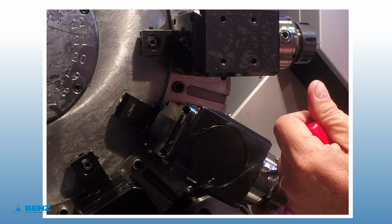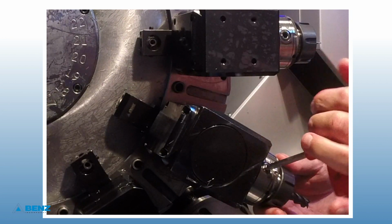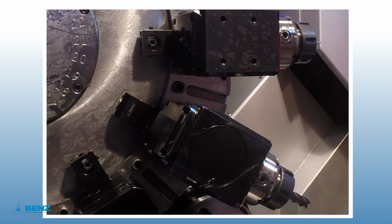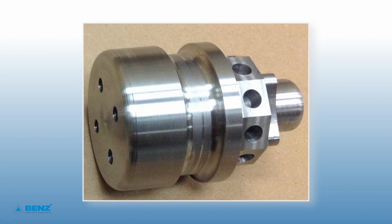As you will see, positioning the tools in the turret for a faster cycle time is not the issue. The idea is to position the tools to allow for fast setup by changing only the Solid Fix adapters with a safe one-handed method in less than 15 seconds. Once all of the parts have been machined, we will make the following changes, which will allow us to set up the next part in less than 5 minutes.